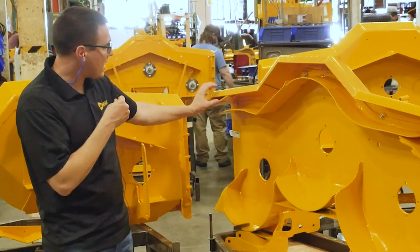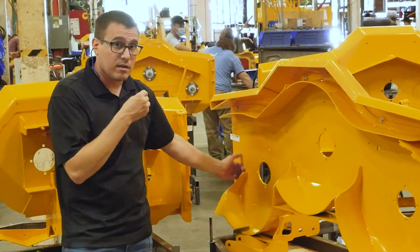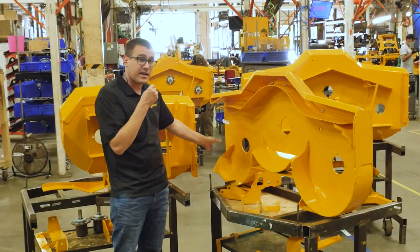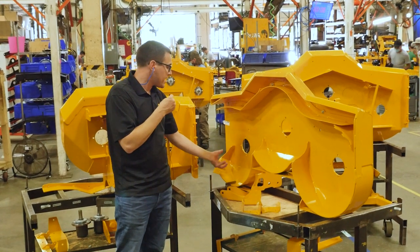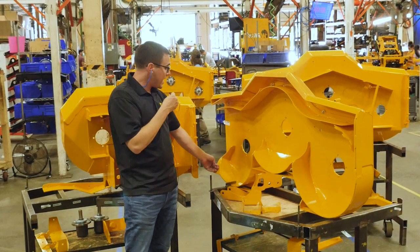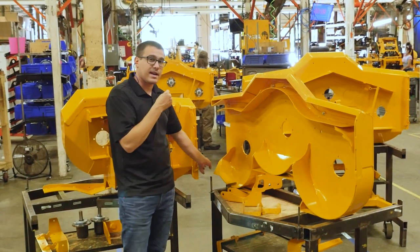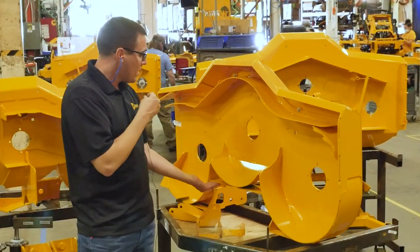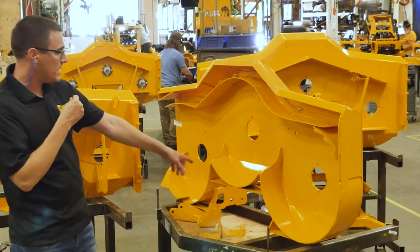On this side of the deck, we've got a triangular piece here for reinforcement. On the back, we have this little baffle. As the blade is spinning, the grass in this area can have a little bit of confusion. This splits the flow — grass is going out here and this area is going in and getting cut. This tapered surface right here prevents any clump from building up and then dropping under, creating a continuous flow of anything that comes in contact with it.